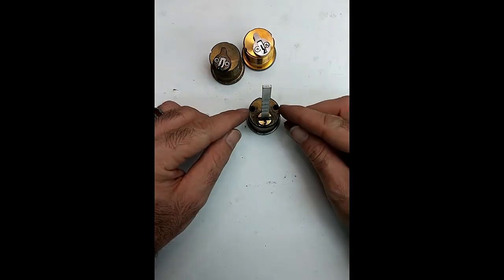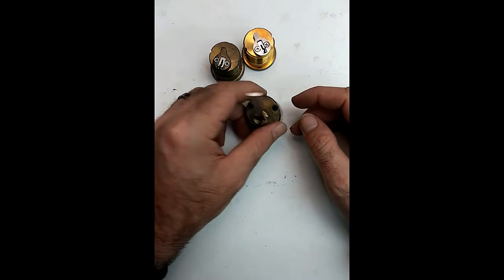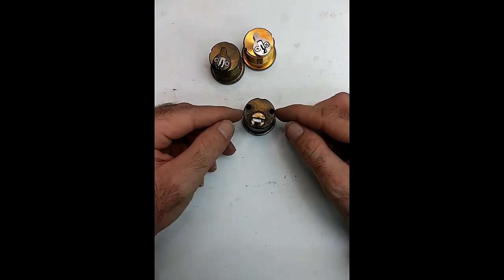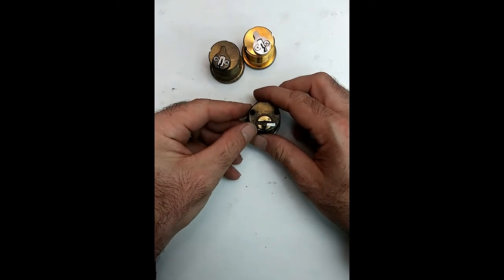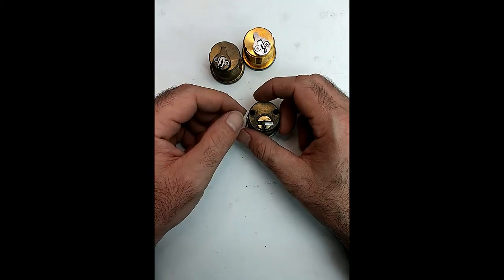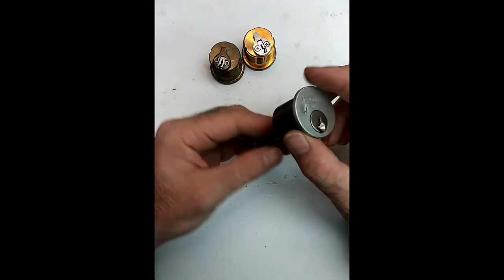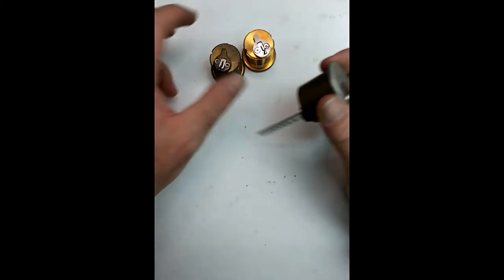Another thing to mention: the location of these holes for a Sargent actually sits about a sixteenth of an inch higher than the standard Ilco rim cylinder. Ilco is used commonly because it is cheap. The prep on these is different. Some aluminum doors will have two cut-outs and one additional cut-out, whereas some doors will just have a single circular cut-out, which works great with a flat plate that sandwiches the cylinder to the door. So if you have a Sargent cylinder, you have to replace it with a Sargent cylinder. If you have an Ilco one, an Ilco one would work just as well.